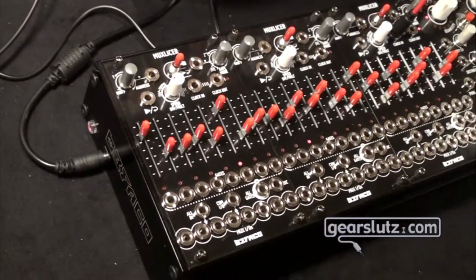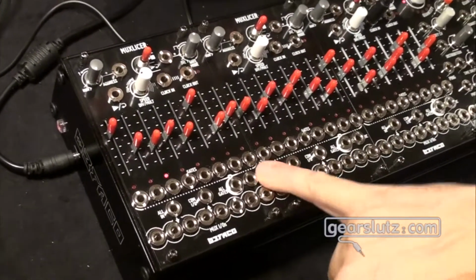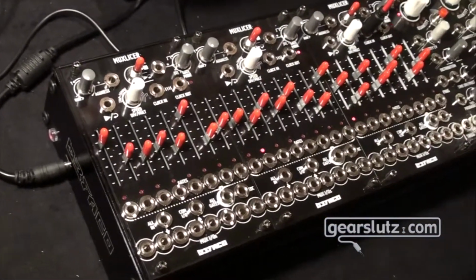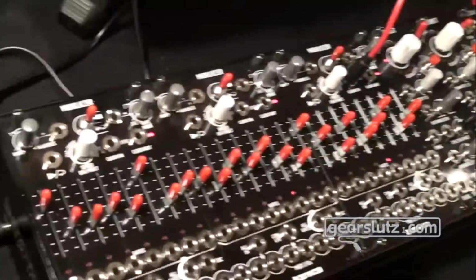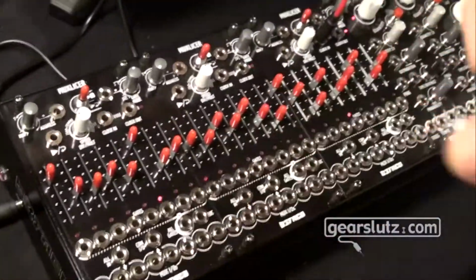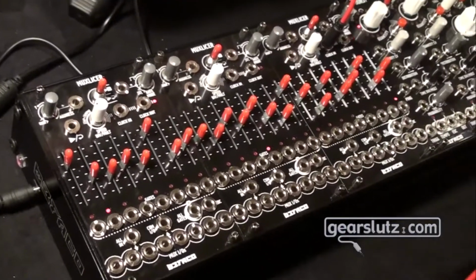Also, a nice feature I like is that you can chain more than one, because you have an end of cycle input and a one-shot play input also. So you can have as many as you want working in a row. And if you use the CV on the first one, what happens if there are multiple changes? It jumps to the moment it should be if you didn't change that.